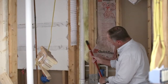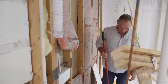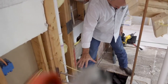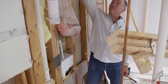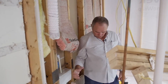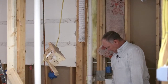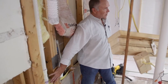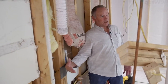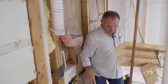We're not only going to have to add studs here to carry that load, we're going to have to have something down below that carries that load. Otherwise you'd see all of this flooring starting to sag. If the floor starts to give way and flex, we're going to have flex in the ceiling too. You need that pier to be directly under there with the corresponding posts in the actual floor structure — not just on the walls. A lot of people will put the structure up and it looks great, but later the ceiling starts to sag and the floor gets a dip in it.